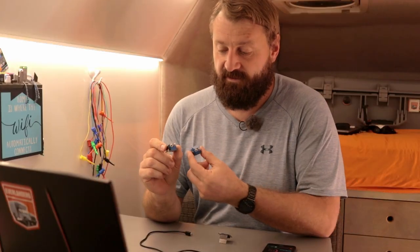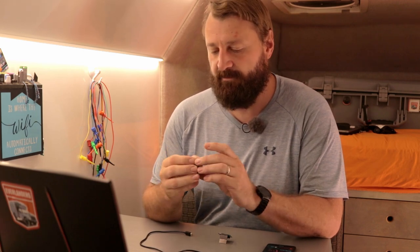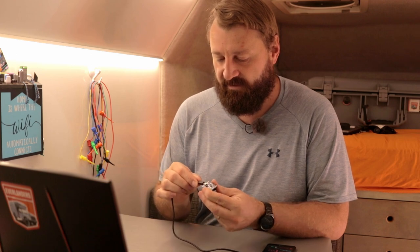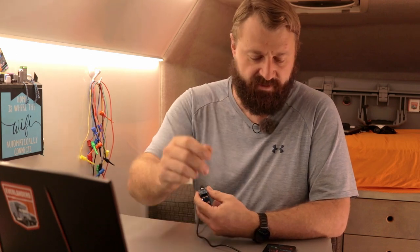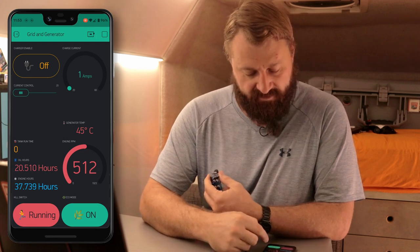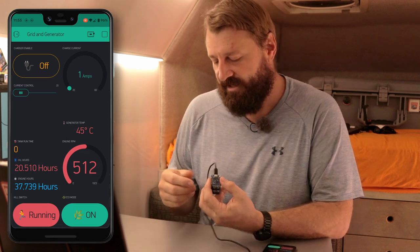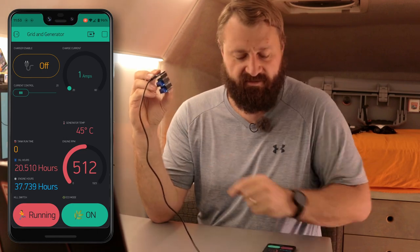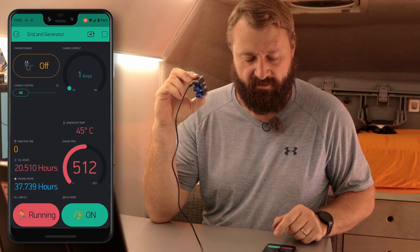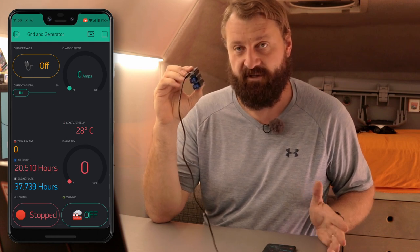To put this all together I'm going to need two relay modules — one for the eco mode switch and one for the kill switch — so I'll stack two of those up, and then one Wemos D1 mini microcontroller. To power it temporarily I'm going to run it off USB from the laptop. As you can see on the app, the unit has come online, the eco mode switch gets triggered on by default, and the kill switch is running. You can see the two little blue LEDs — this is the eco mode switch and the run/kill switch. When I hit that, it closes the relay and that will kill the generator.